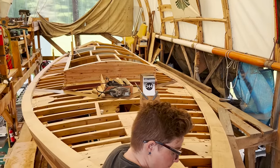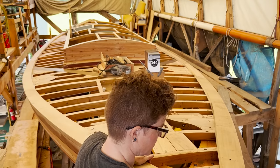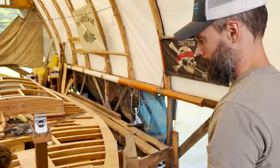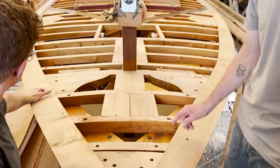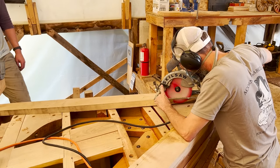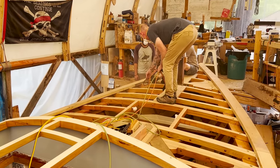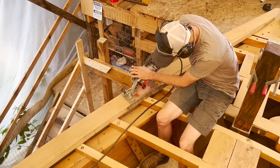I've got some wedges pulled out, air compressors fired up, brand new blade in the circular saw. We need to grab an impact gun. And what I'm imagining is someone will go just ahead of me and pop the screw just before I get to it with the saw. Because some of them, especially like this one, are proud and I'm not going to be able to float them. So if someone goes ahead and pops the screw, that same person can slide in some very fine wedges. And if it's somewhere like here where the camber is getting us to float a little bit anyways, we don't need to worry about it. But if we have a spot where we're nice and tight and hard to a deck beam, we should just slide a wedge in there.